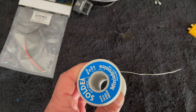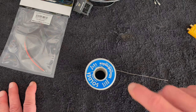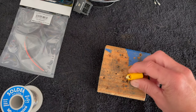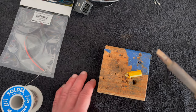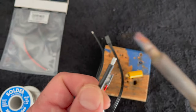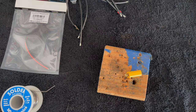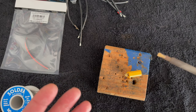I'm fortunate that I can still find rosin core leaded solder - obviously there's a reason the whole globe uses lead-free solder now, but for hand soldering my toy trucks and RC cars this stuff works fine. I like to have a wood block and something to grip my plug with so that it doesn't flop around - a pair of vice grips works great, you can just clamp these on there. Size matters when it comes to soldering - if you're going to solder big wire you want to have a decent size tip. This is 12 gauge wire and the tip is larger than the wire width, so you need a substantial iron for big wire soldering.